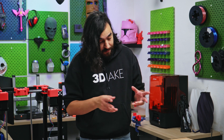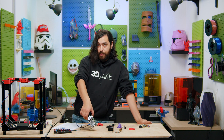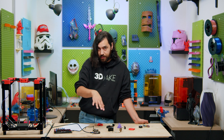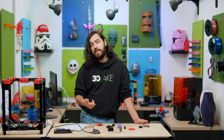In other news, we've been getting requests for how to set up Klipper on your main board and Pi. This is the Pi we're using — the BTT Pi version 1.2. It is more or less a clone of the Raspberry Pi 3B: 1.5 GHz processor, 1 GB of RAM, integrated Wi-Fi, 4 USB 2.0 ports, a USB-C for power, a micro HDMI port, an SPI port for displays, 12 or 24 volt power inputs, an ADXL345 accelerometer port, a CAN bus port, an Ethernet port, and a fan port. It also comes with a heatsink. Importantly, it uses a different processor than the Raspberry Pi — the same one as the BTT CB1 — so the default Klipper image for a Raspberry Pi is not compatible with it.